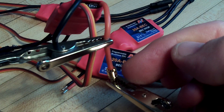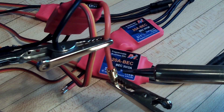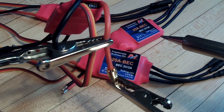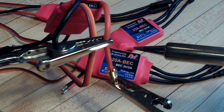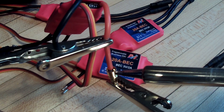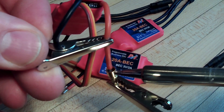You've got the hole — the soldering hole — over here to get your iron into. I've got my Weller variable power, it's a Weller WES51, an excellent soldering iron, adjusted to about 680 degrees. You just get that in there, let it heat up, take a couple seconds, and get your wire just where you want it.